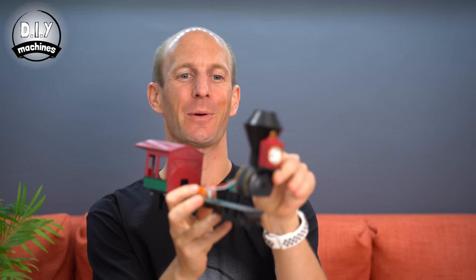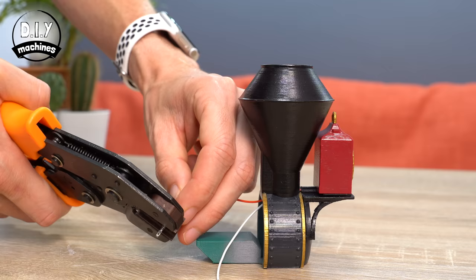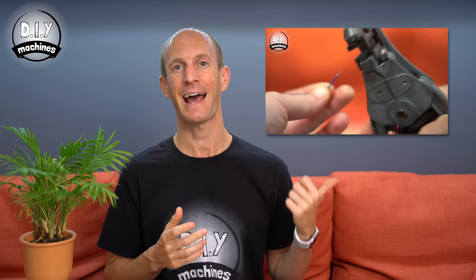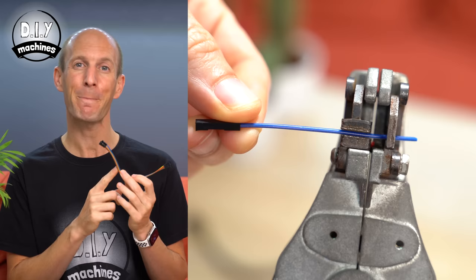Our model train project is now very quickly taking shape. Now that the wires for our LED have passed through the narrowest parts of the project, we can add some Dupont-style female connectors to the end. I made an entirely separate video showing you just how easy it is, so check that out via the card or link below. After these two wires, the rest of the project's electricals are much easier to access. If you don't want to make your own cables, you can opt for using some female jumper wires trimmed down to the required length.